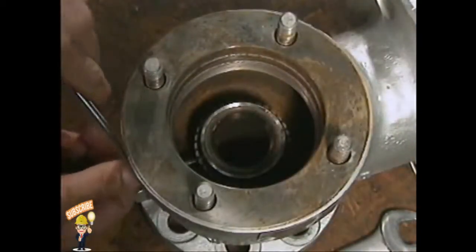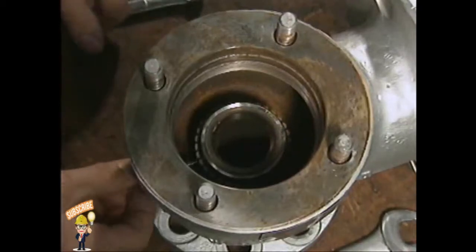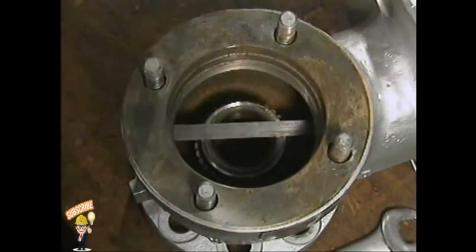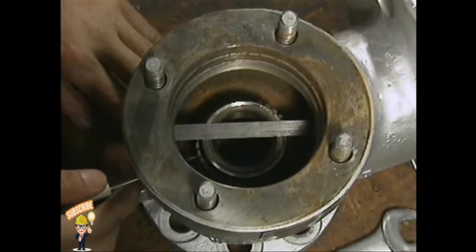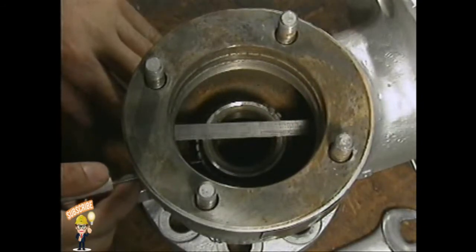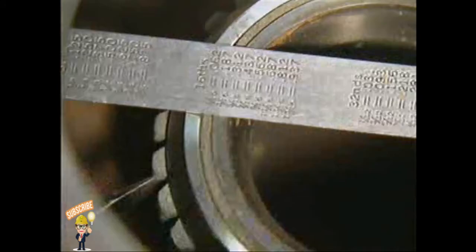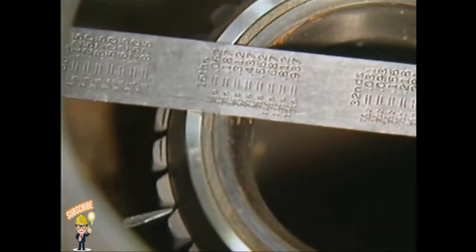Now repeat these steps to remove the locking pin for the lower adjusting ring and measure its exact position. Insert a screwdriver through the lower locking pin hole and unscrew the ring by turning each notch past the pin hole until the ring is flush against the rigid rule placed on the valve seat to take the measurement. Count each notch as it moves past the pin hole while the ring turns.